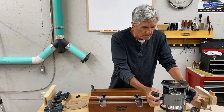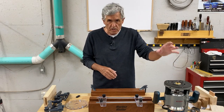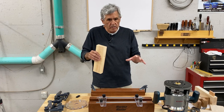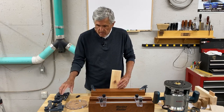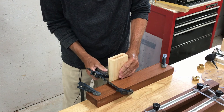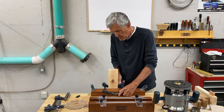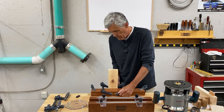You might want to check it every once in a while, but for the most part you're good to go. I'm going to show you how to check if your bit's in the center without measuring it, but first we're going to set up a piece of work. Let's say I want to mortise this end grain here. One way I do it — I didn't used to have a vise, so I'd clamp a scrap board to my table on my workbench, and then clamp my work like so. Another nice thing about MortiseMaster is you can get your work up where you can see what's going on — it's not down and away from you. If you decide to buy one of these, I think you're really going to like it.